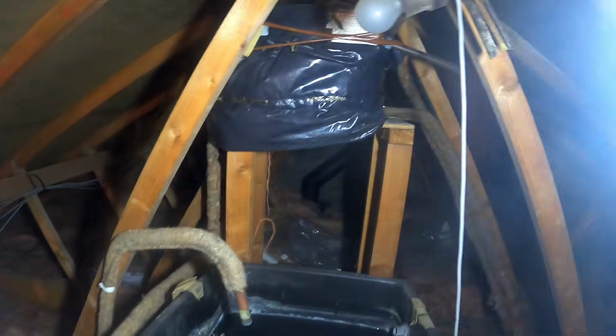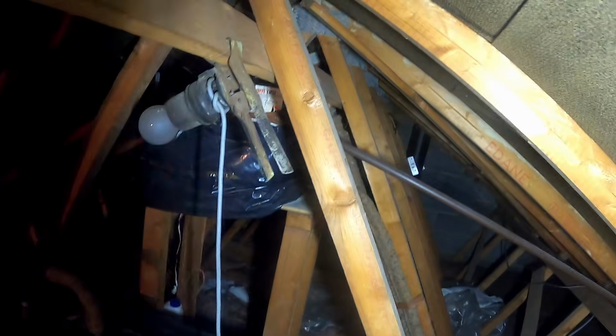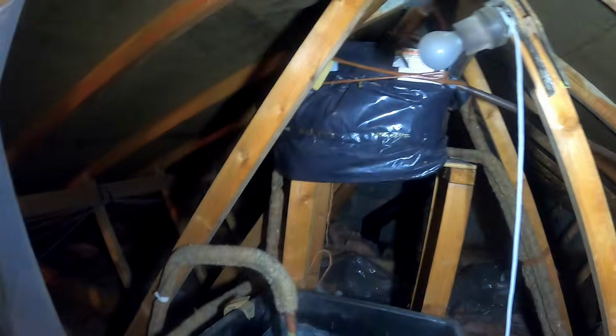What we're going to do, we're going to get this feeding vent capped on this header tank, and this will create a vacuum so we can just cap them pipes off one at a time. We've isolated the power to the boiler. I don't know if I can get my camera up, but that bung goes in the feed, and then we just cap that vent. So when we cut them pipes downstairs, as long as we do one at a time, working on the principle air can't get in, water can't get out, we should be fine just to cap them, save draining all the system.